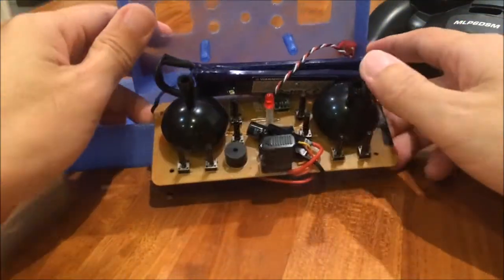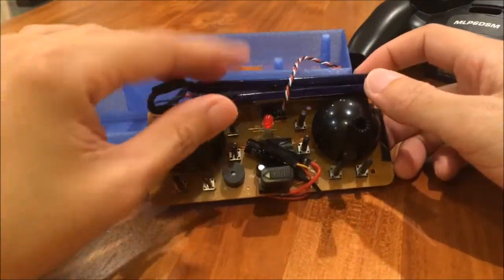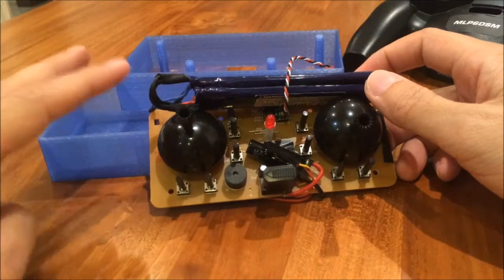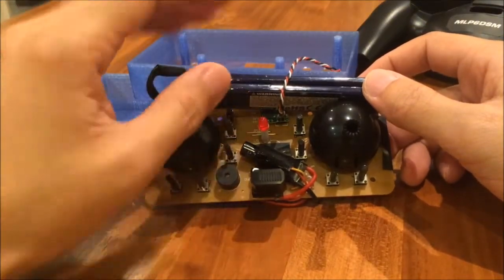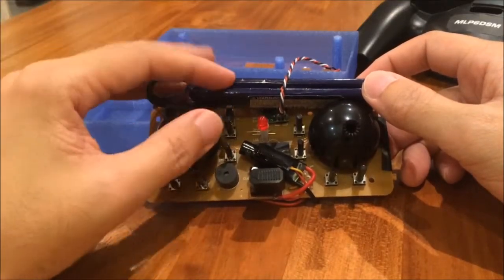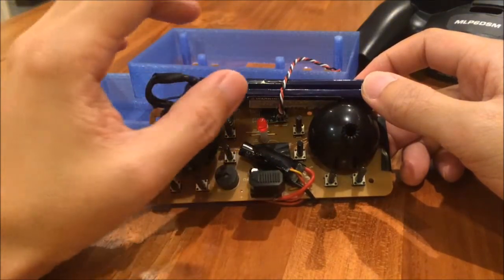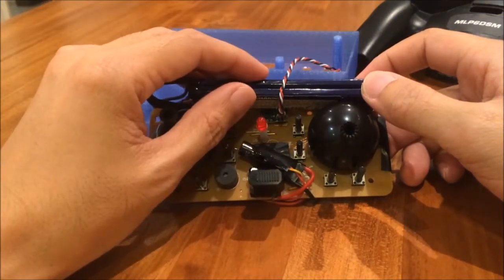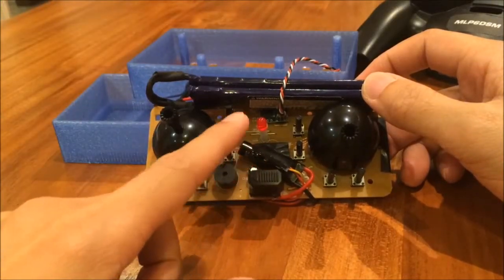As you can see, I have the transmitter powered by lithium polymer batteries instead of four AA batteries. For the transmitter to be able to work on this two-cell LiPo pack, you need a step-down regulator. I have a step-down regulator here which steps down the 7.4 volts — or 8.4 volts on full charge — to exactly 6 volts.